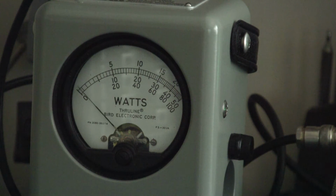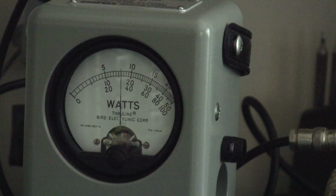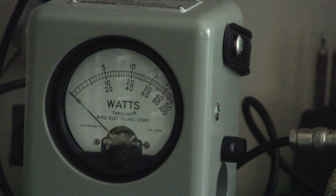I'll just turn it off for a second, so I don't want to overcook the PAs. Ten seconds maximum, they say, for tuning the PA at maximum power. And I've got the fan running in the background all the time just to make sure. Very important to keep the valves cool. I'll have another little go here. Alright, that's about 100 watts output for 250 milliamps of cathode current.